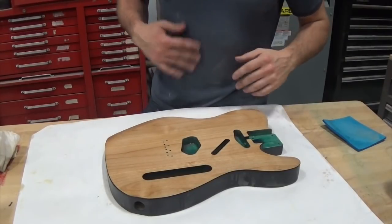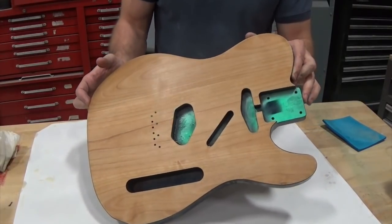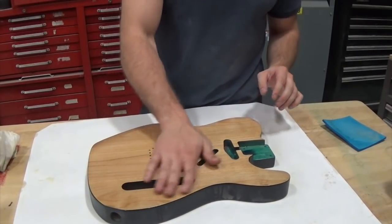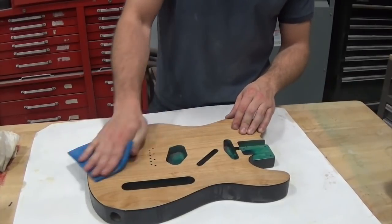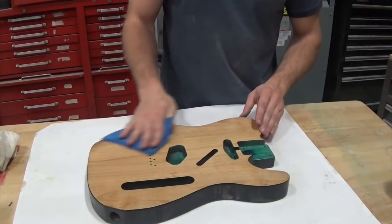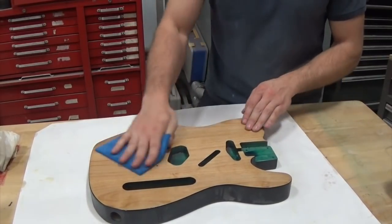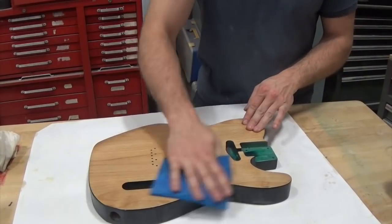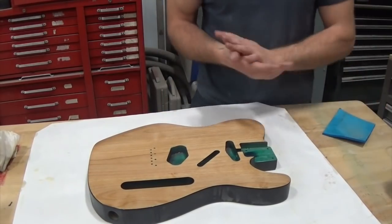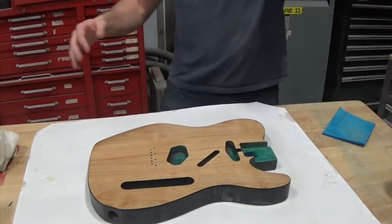This has had some time to dry now — probably half an hour or so — and it's got a beautifully smooth finish at this point. Not glossy, because there isn't enough material on there to make it glossy, but nice and smooth. I can go in and just lightly sand this. If you're applying a coat on top with the rag the normal way, the product recommendation is to let it sit for three or four hours before lightly sanding it, but because I've sanded those first two coats and rubbed them right into the wood, I'm comfortable waiting just 30 to 45 minutes.